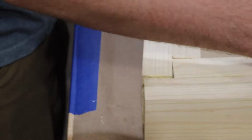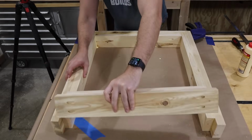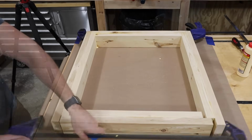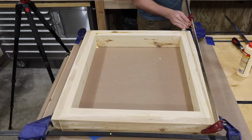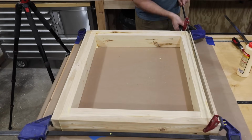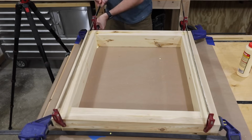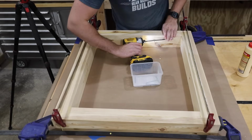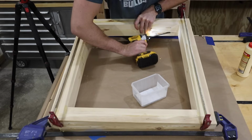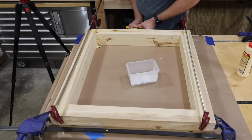These double lap joints are great because they are really strong and they ensure that the joint is square. I positioned the pocket holes so that there are 8 on the 2 boards at the top of the legs that will be up against the table, and 4 on the bottom board that touches the ground, and none of these will be visible.